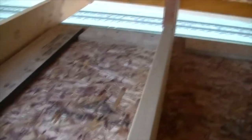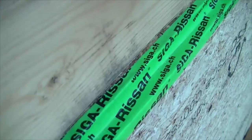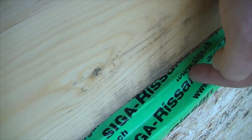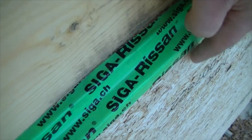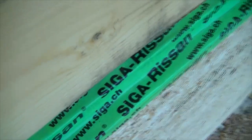If we go on top, you can see the nailer was just ripped scrap — nothing special. There are some blocks down there; again, they're just nailers. Then right there is the top of the OSB, which is my air boundary, and here's the exterior sheathing, also my air boundary. I made that connection before I set any trusses, and you can see that very clearly along the outside.